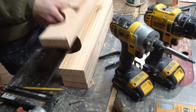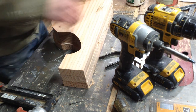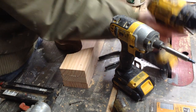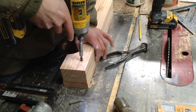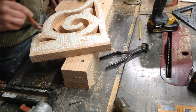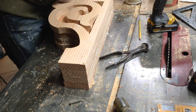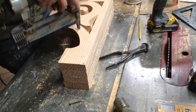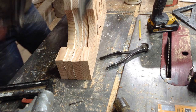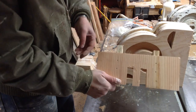To glue these together, I glued together three pieces and then screwed three of them together. I didn't want a lot of exterior hardware, because even though these won't get a ton of rain, that's where stuff will fail - if you have hardware where water gets in, it rusts the hardware and then it starts to rot from the inside out. You can see I put those screws on, and then the top piece will hide those screws so water will never get to them. Then I just attach that top piece with some brads - I would have loved to have screwed the whole thing together, but I settled on all three being screwed together and one being bradded in place.